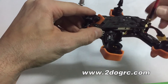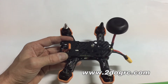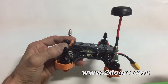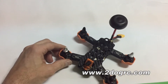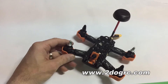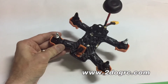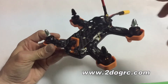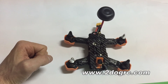This ship is very nice right out of the box. A right-hand circular polarized antenna comes included — that's really good. A lot of ARFs come with stick antennas which aren't very good for FPV flying, and Diatone knew that and put something good on here. There's your XT60 connector. I would run those three-inch props on 3S — you won't have any problems with power. You can even run 4S and it'll be really zippy. This is a very durable ship — the Diatone 150, available now at twodogrc.com.